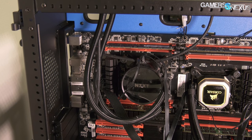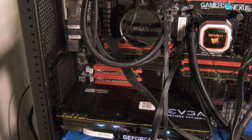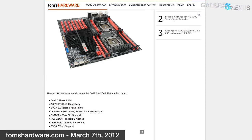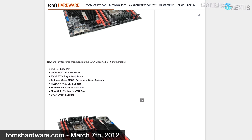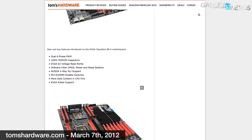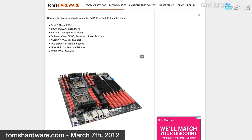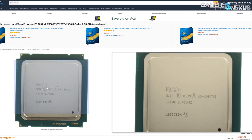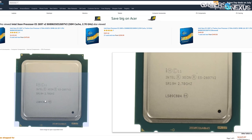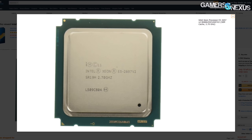This content combines a lot of cool things. We have the tragic EVGA SRX, a board that was purpose-built for overclocking the Intel Xeon CPUs, and would have been the only dual socket board really capable of it. The board has seven PCIe slots, a big chipset and VRM heat sink, and a VRM and BIOS that were going to be prepared for overclocking. Unfortunately, the Intel Xeon CPUs of that generation ended up being locked for overclocking, and so EVGA was stuck with an overbuilt dual Xeon board that couldn't fulfill its purpose.